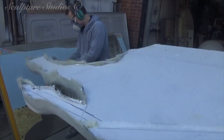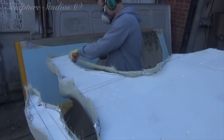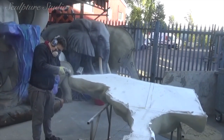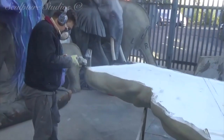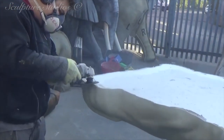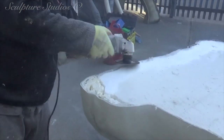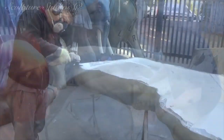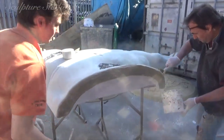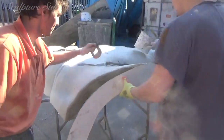We've gone over with glass fiber as a relatively thin, lightweight shell, and to give this shape a bit of rigidity we've beefed up around the edges with a couple of extra layers. Once all of the excess material has been trimmed around the perimeter, we need to sand the whole form down to remove any sharp points. Fiberglass has a naturally fibrous texture, so we go over the entire form with a flow coat layer of resin, which will soften that texture and can be sanded back to an even smoother finish.